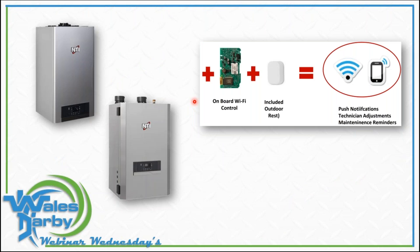The first boiler I worked with here — the NTI boilers — they have onboard Wi-Fi. What that does: everybody's used outdoor reset sensors, but with this setup, if I hook up the onboard Wi-Fi to the homeowner's network, it geofences — based on my location and the address, it utilizes the weather in that area, not an outdoor sensor. So I don't have to run a wire. I'm always going to get great weather detail as long as we have Wi-Fi. We can set all that up through the NTI network, and we don't have to touch the boiler. Imagine not having to send a tech to a job — just go on your dashboard, control the boiler, send signals from 300 miles away. You don't have to roll a truck.